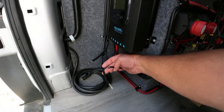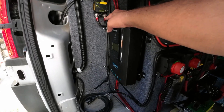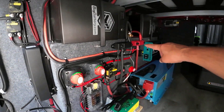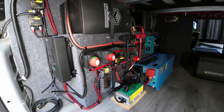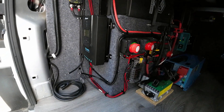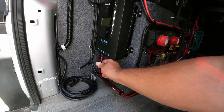I've yet to hook them up — we're getting ready to do that in just a second. Same way with the battery: I run my positive right here, so it's going to connect into this slot, and we've got it all tied into our bus bars. I think I've made a clean job out of everything. I know where everything is and double-checked it, so polarity should be okay.